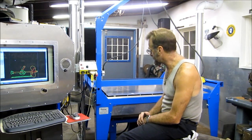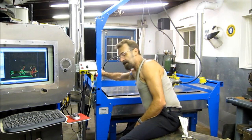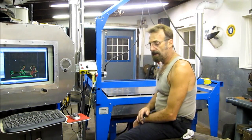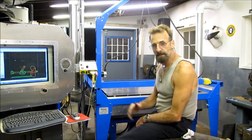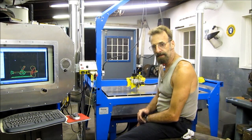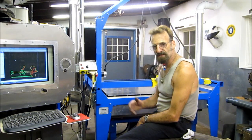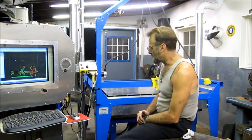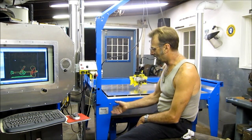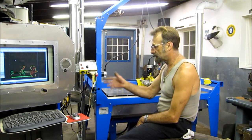I've been running fine all day. I did a couple of practice cuts and things like that. But I was also concerned because I was feeling the motor temps and the Z-axis was getting a little warm. It all makes sense — if you're not getting the right signals and not 100% secure contact, you're going to have great heat, and this arcing causes more heat than direct contact. I went the extra mile to not have wires on the floor — all separate surfaces for each component.